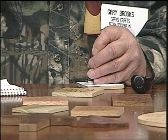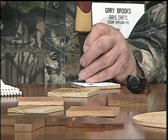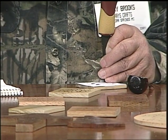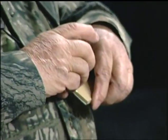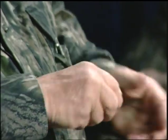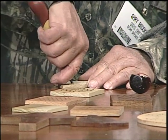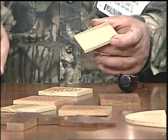Here are some coasters I made. I take a piece of clear plastic, cut it to the size of the coaster, and lay it on the pattern paper to get it centered. If you don't have the pattern just right, you're going to get the pattern offset on your piece of wood. Once the pattern is laid out and you remove the tape, you can see right away if you've got all the diamond cuts in. Then you set in and cut out the chips, always on the convex side.